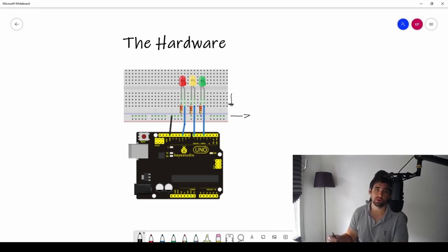If you want to change the pins, just remember to change them in the code later on. We do the same for each LED — each LED will have a resistor from ground and then the long leg back to the Arduino. The current will flow through the wire, into the LED, and out back to ground. Current always flows from positive to negative, so when you switch on the LED — for example, making pin 4 high — the current flows from the pin, through the LED, back to ground. That single ground point serves all three LEDs.